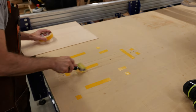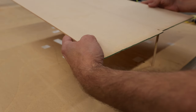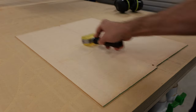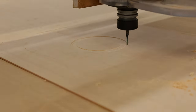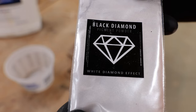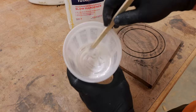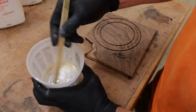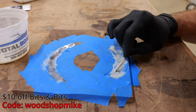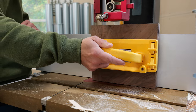Over at the ShopBot CNC, I set up to cut the rosette, sound hole, and a slightly oversized profile of the top, using double-sided tape and dowels for alignment. A roller improves adhesion when working with double-sided tape. For these operations, I'm running a 1/8-inch down-cut bit from Bits and Bits — they have a wide variety including tiny 23-thousandths end mills great for fret slots and inlay. Once the epoxy is cured, I cut a slice off the walnut and carefully pry the rosette free using a putty knife.